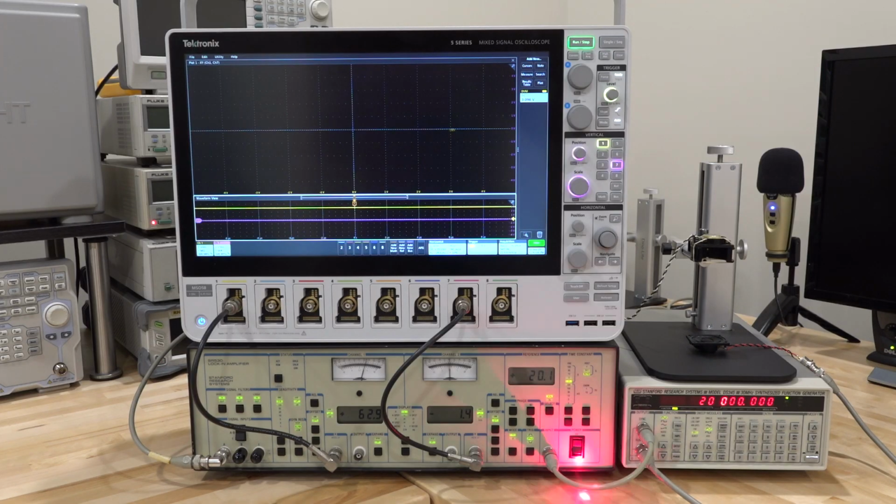It means that an electrical signal comes over here, goes to the first speaker, becomes sound waves, gets propagated upwards, gets picked up by this speaker, and then it goes all the way back to the input of the Lockin amplifier. So sound generated by the bottom speaker induces a current in the top speaker. So now how does the phase work out in all of this?